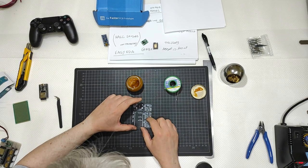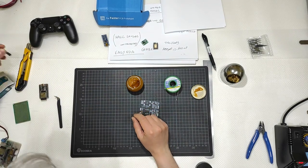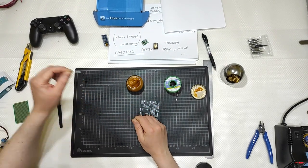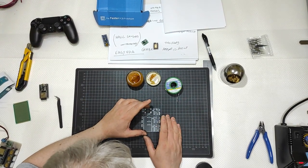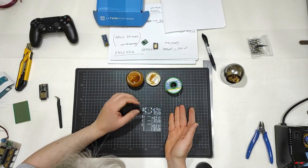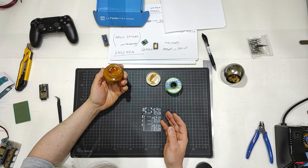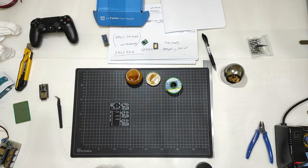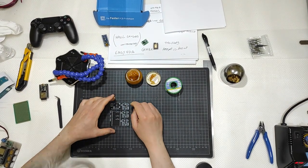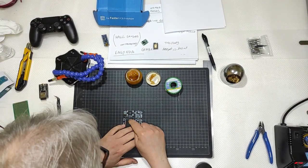Sometimes like this one, they could have oxidated, okay? Or the components such as the leg of the capacitor could have been oxidated. So when you solder something, you simply need to use a tin with a flux, or a little jar with some flux paste inside it. I will also use my other set of hands if needed, like that. Where will I start? I will start from J1 and U2.